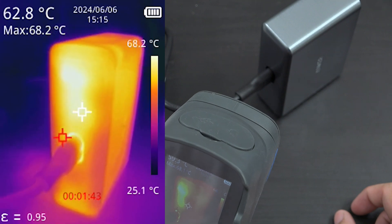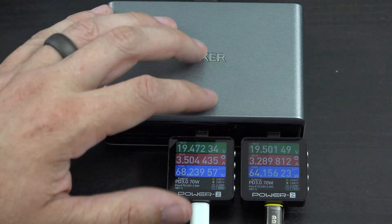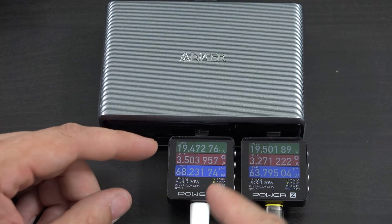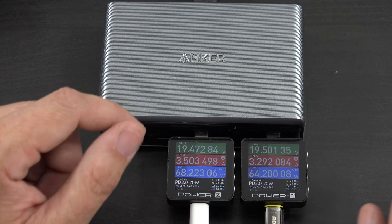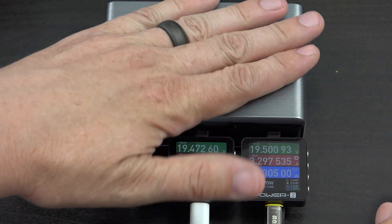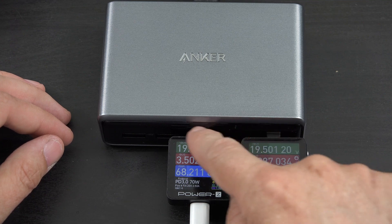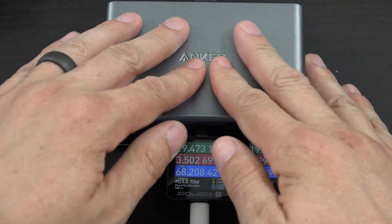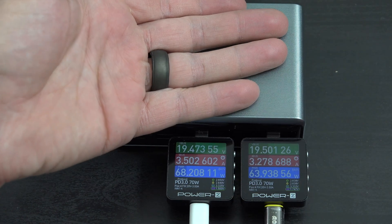It's cooling down — 68, was at 69. This thing is at about 70 degrees Celsius on the outside and we have throttled: no longer getting 100 watts to the MacBook and 100 watts to the power bank. We are getting 65 watts to the power bank and almost 70 watts to the laptop. Even at 70 degrees Celsius, in my opinion it's handling the heat very well and evenly distributing it — the hottest point is right at the outlets, the rest is around 65–68 degrees.